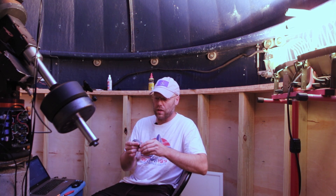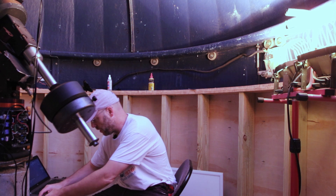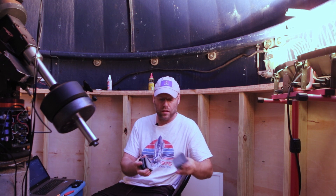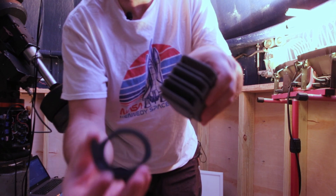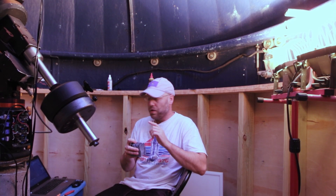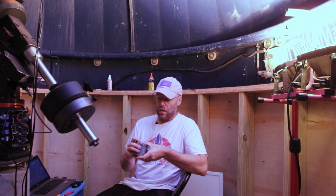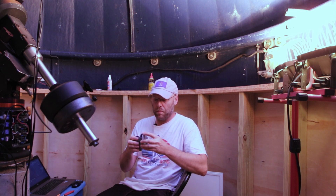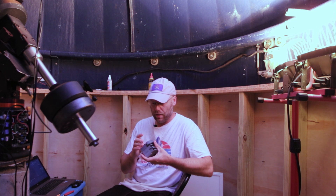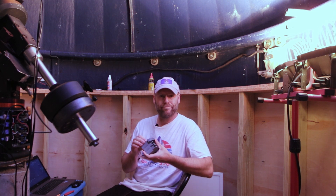With these shrouds glued on, it doesn't leak anymore. I also modeled storage boxes for the sliders — they link together like this. I'll put the models up for download. These models are tuned to my SLA printer, which bloats the prints, so you might need to fatten them up a bit to get them to grip properly. It was surprising that I had to stop the light leaks like that — I was slightly disappointed, but that's life.